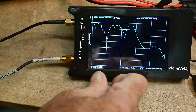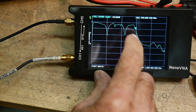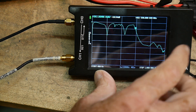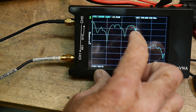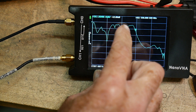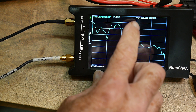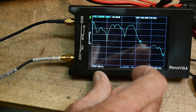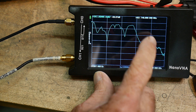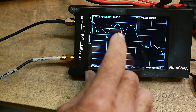Sorry, getting all kinds of reflections here. So there's some bumps here that I think are just resonance in the cable length, so I'm not worried about those. And here's the cut — the cutoff is here up around 590 megahertz. So this thing's supposed to go up to 512 megahertz, something like that. They want to have this point here dead at one gigahertz at least, so there's 740 — it's at the very very bottom. There's 740 megahertz but it's passing all the low frequency stuff.